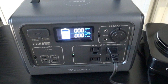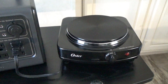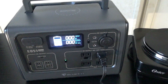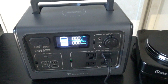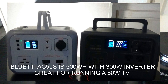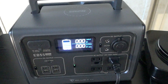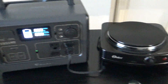The big question is whether it can power a higher-wattage load, because that would make it worthwhile. That's why I always say: get at least a thousand-watt inverter in one power station, and then get another power station with just a two or three hundred watt inverter for smaller loads. That smaller inverter is going to run small loads a lot more efficiently, because the AC inverter itself uses power, and generally the bigger it is, the more power it consumes.